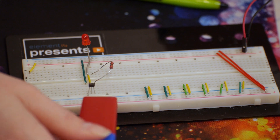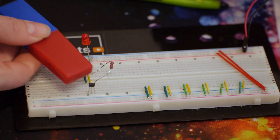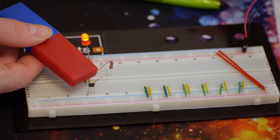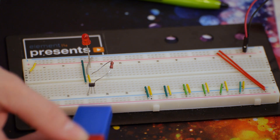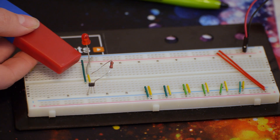What's interesting is while the face of the sensor does not respond to this pole of the magnet, if I bring that pole of the magnet to the back side of the sensor, it turns the LED on. I can use this to my advantage — one face of the magnet turns the sensor on this way, while the other face of the magnet turns the sensor on the other way.